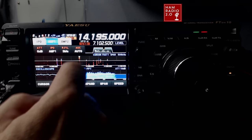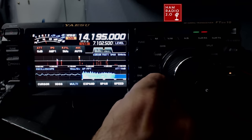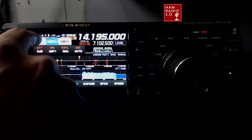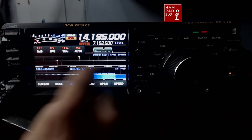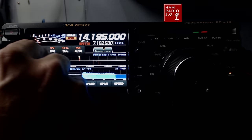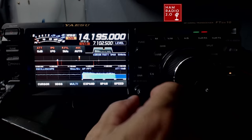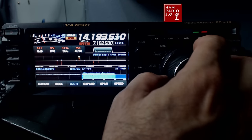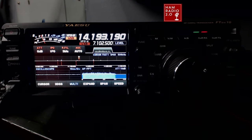You can go in there and turn off the amp and go into the IPO settings — that really quiets the noise down as well. We're going to talk about IPO with Doug here in just a second, but if you just do those two things and then adjust your RF gain, you can clear out a lot of noise. Let's get Doug on and talk about tuning the receiver on the FTDX10.